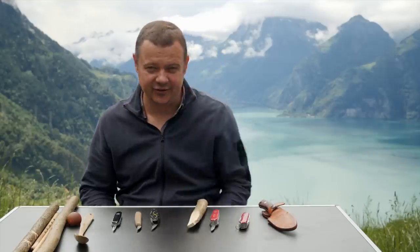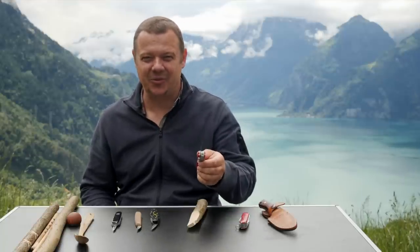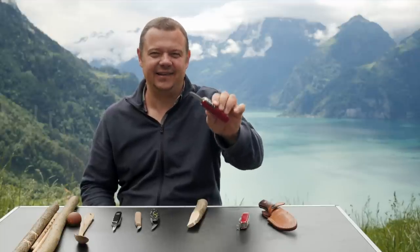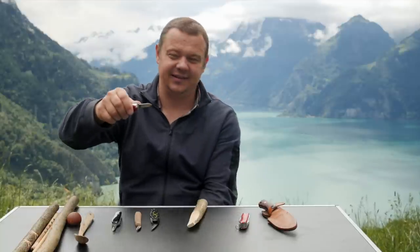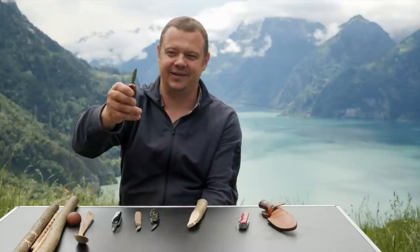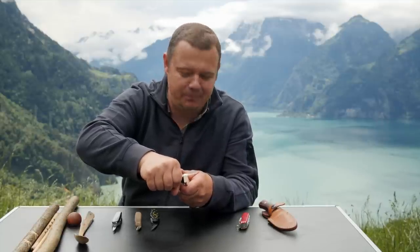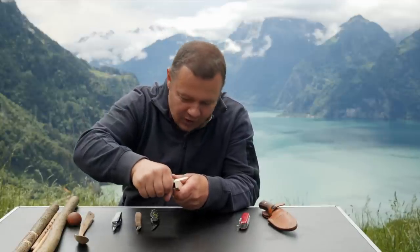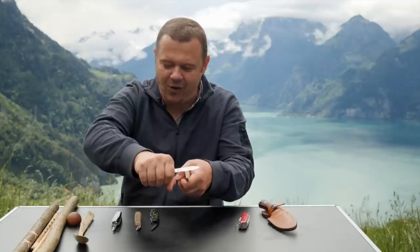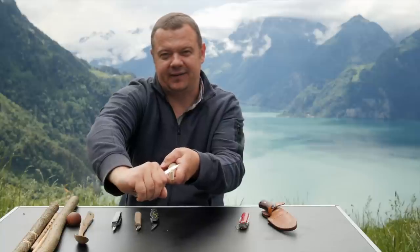The fourth advantage. I speak with the experience of more than 300 carving workshops. With the small blade, significantly less cutting accidents happen than with the big blade, because beginners and kids have the small blade better under control than the big blade. They carve much better with the small blade because they carve closer to the hand. That means they have better power transmission and better control. If you carve with the big blade at the end or middle of the blade, you always have a big leverage between the hand and the wood, and this makes your wrist bend backwards with every cut.